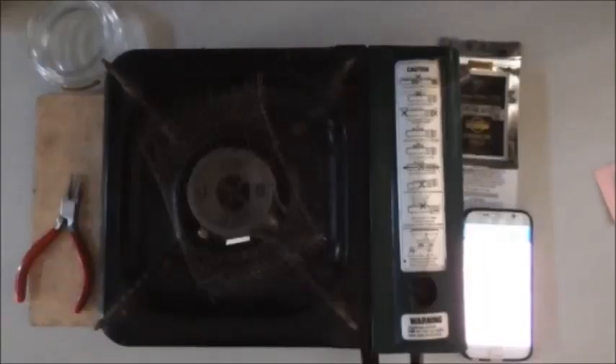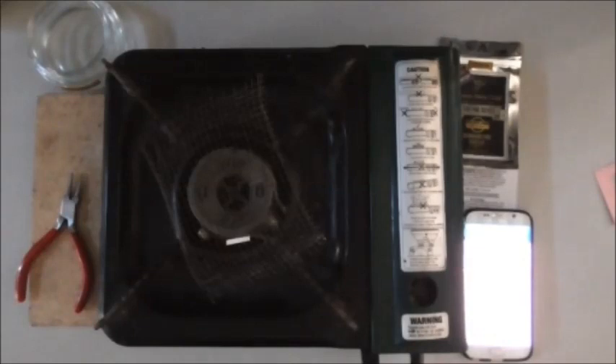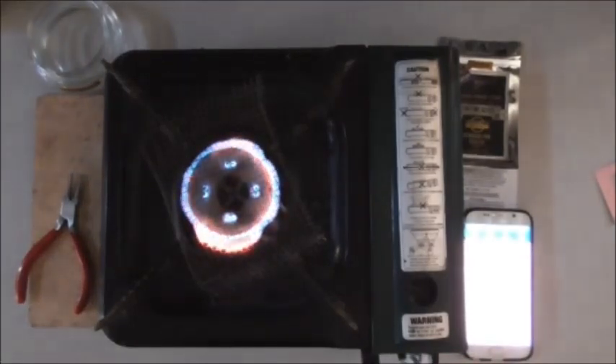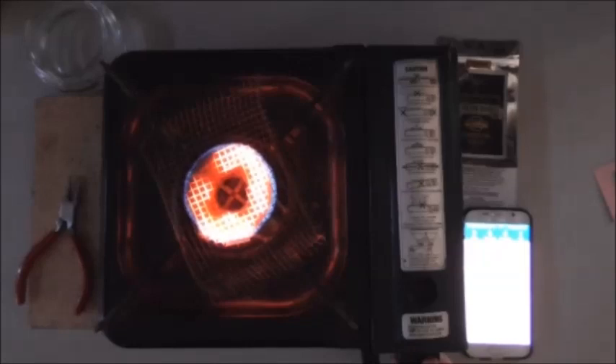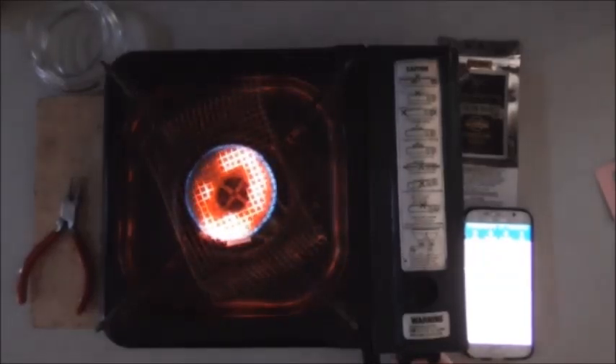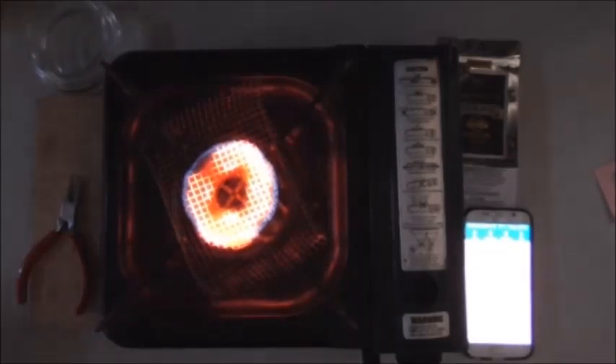The next thing I'd like to share is a little camp stove right here — they're reasonably inexpensive. I have a little test piece ready to go and we'll fire for around about six to seven minutes and then do a bend test to see how we go. Turn the stove on and you can warm it up by just dropping the temperature a little, allowing the binder to burn off, then raise the temperature. Keep a close eye on it — as it starts to get a little bit shiny with little freckles of shine to it, it's getting too hot and you'll need to drop the temperature.